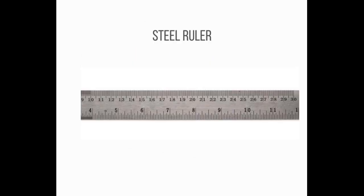Number 18: Steel rules, also called rulers, are essential in any shop when accuracy matters. Steel rules are inherently more accurate than folding rules because they are made in one piece and so avoid the inaccuracies — however small — which are inherent in folding rules because of the play in their hinges. The requirements for accuracy in steel rules vary greatly, and the range of products varies likewise.